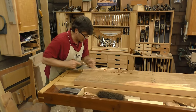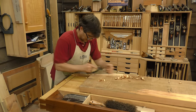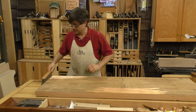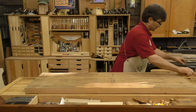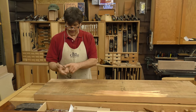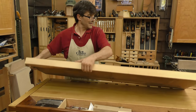You can use a jack plane. You can even modify a smooth plane. I like this just because of those characteristics I mentioned. It's got a big heavy blade that doesn't vibrate. Got a big open throat. It also has a really large rear tote so you can get all four fingers around it, whereas most planes are designed for three fingers. The bottom three, the index finger points along the side of the frog.